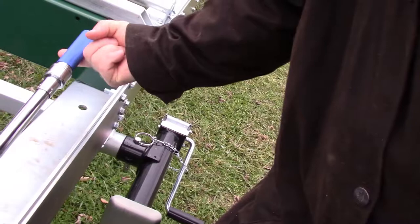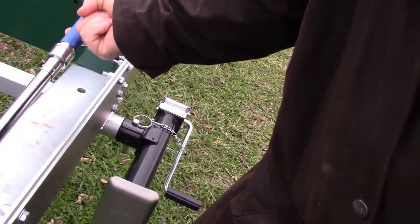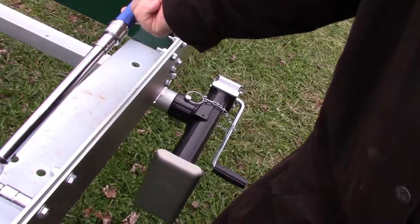Torque wrench, 25 pounds of pressure. Every time that clicked, that was 25 pounds. It took one finger. Now, I understand it. Sometimes I don't know my own strength, but 25 pounds, one finger? Really? Since it never clicked and I was waiting for a torque wrench to click, I over-torqued the blade. I way over-torqued the blade.